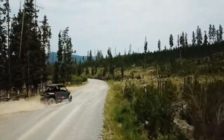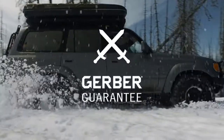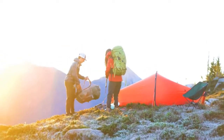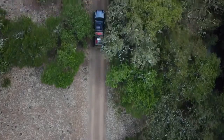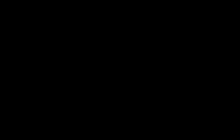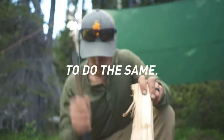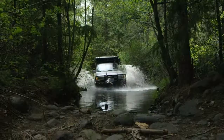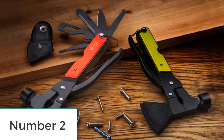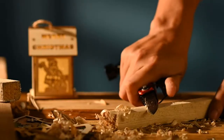The Truss has an anvil-style wire cutter rather than a bypass, so the cutting surfaces meet at the point when the pliers close. This forces the wire apart rather than shearing through it, which doesn't cut as cleanly but is stronger and works better on hard wire. The three sizes of flat screwdrivers worked well covering the range of screws we encountered. The serrated knife blade and the plain blade were both very sharp, easily cutting string, twine, rope, saplings, and wood. The can and bottle openers performed well, and despite their small size the scissors could cut intricate shapes from paper and light cardboard.